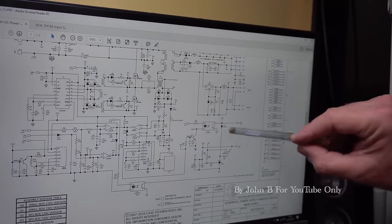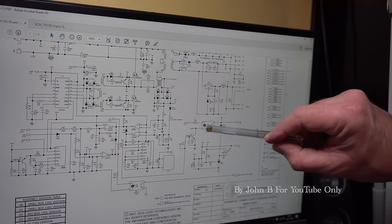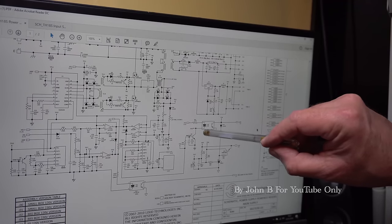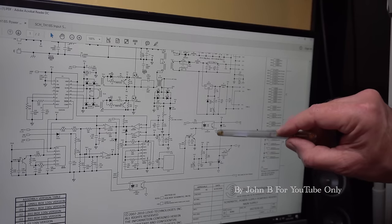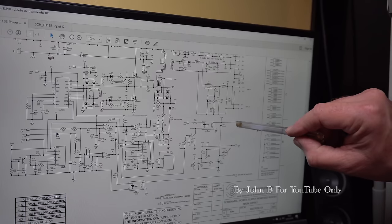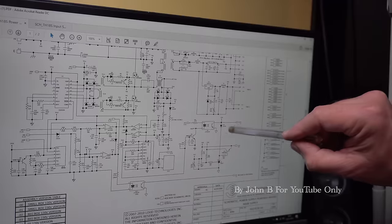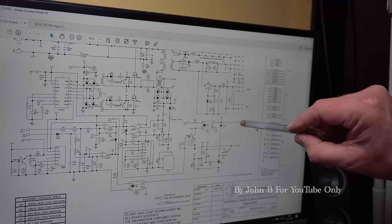Different ground potentials. So if there's a fault, this opto-isolator turns on via these components and it pulls this down to ground. And so on that limit line, which is the thermal light, that's being pulled down to ground, bringing on the light and knocking off the power light.